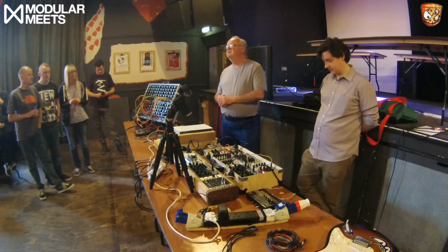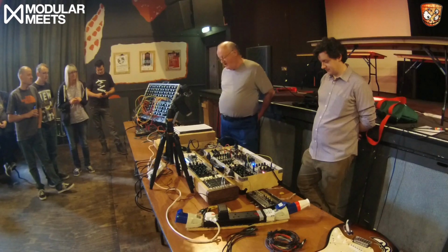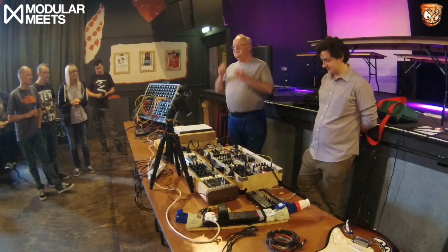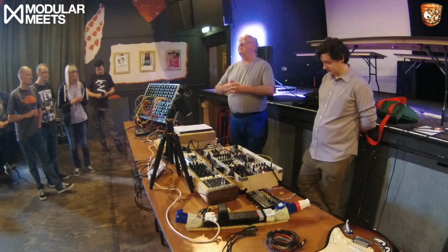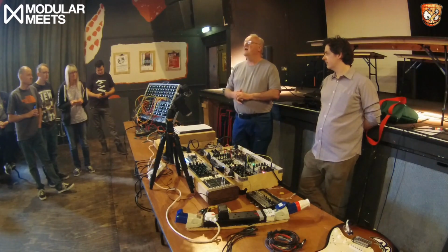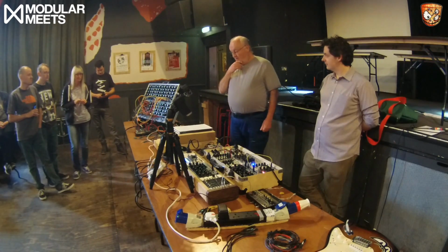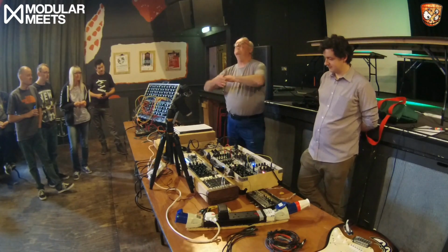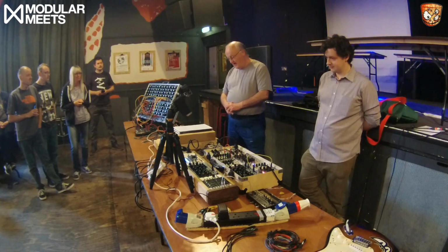Chris was thinking of doing something similar and endorsing it, and when I got involved I thought, no, actually this isn't the right thing to do. The original Gristleizer doesn't need anything much doing to it, because it's a complete composite thing. It's got four elements: the preamp, the LFO, which can modulate a VCF or a VCA, but in its interfaces to the outside world, it's got one in and one out. It's a stomp box. When you bring something into the modular world, it wouldn't make sense to just have an in and an out. You'd need to break it into the individual modules. So that's what we've done.